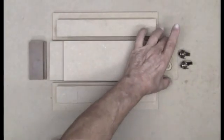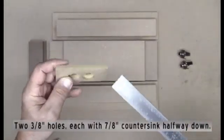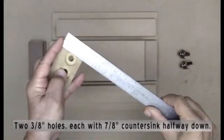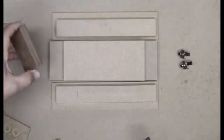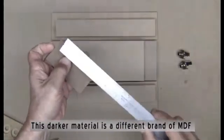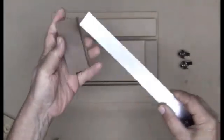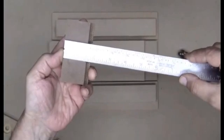Let's start with the side that holds the in and out connectors. It is a 1/4 inch MDF, 3 1/2 inches wide by 1 3/4 inches high. The other end of the case is a build-up of two pieces of MDF. The bigger one is 3 1/2 inches wide by 1 3/4, and the smaller one is 3 1/2 inches wide by 1 1/2.